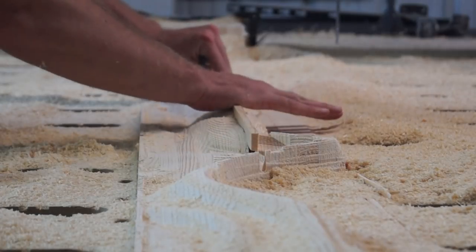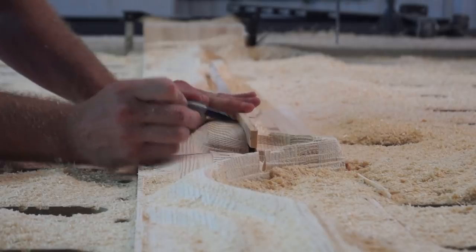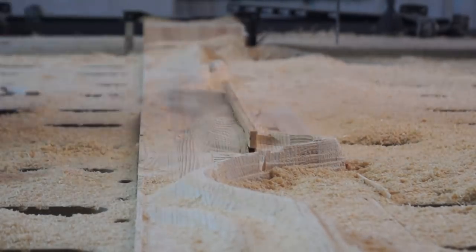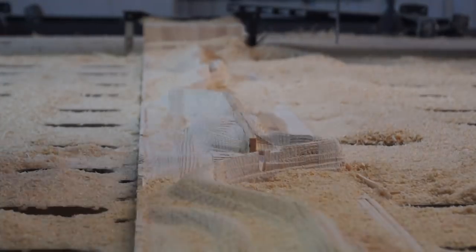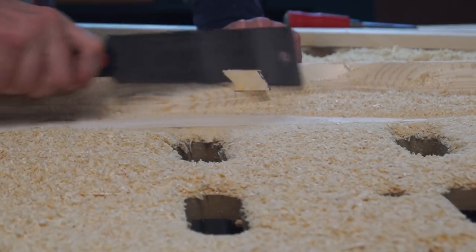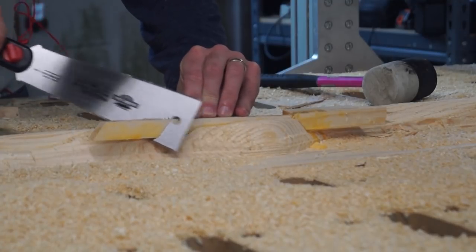Then I test-fit my wood to make sure I had it right, kind of sanded it down so it would fit snug, and marked the edges. The concept is I just stick it in there, cut it down to roughly the right size, cut off as much extra as I can to get it close, and then run that section of the parallel pass with that ball-nose end mill again. So after I cut off all the extra it'll just grind it down smooth as though it was doing the original pass, and you can barely even tell where those big gouges were.